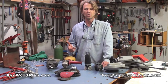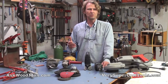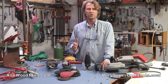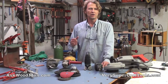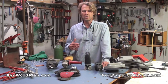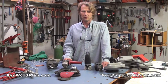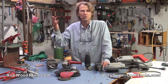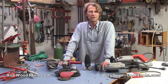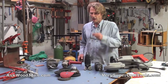The leather apron also protects from the incredible ultraviolet light given off by the welding process. This light is so bright it can damage your skin or eyes if you don't take proper precautions. You also need to protect bystanders — make sure they understand they cannot look at the welding arc — and protect pets that may not have the sense not to look at the arc. Whenever I'm welding, I put my dogs inside.